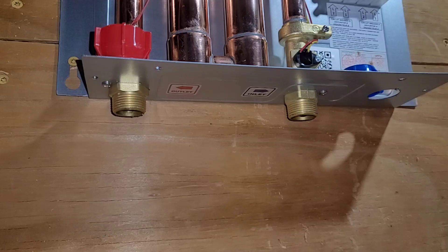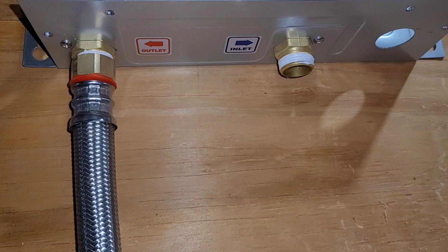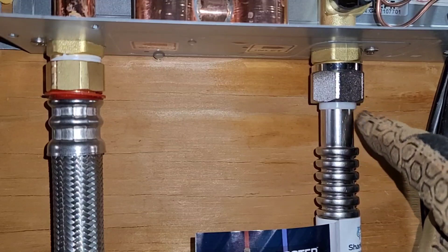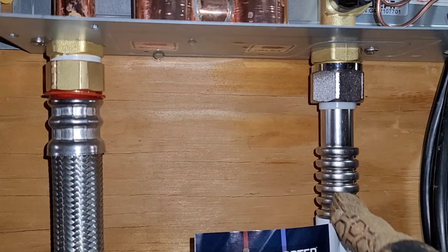For the water supply lines I picked up what they recommended. I put teflon tape on even though there's a rubber gasket on the supply line — just as a precaution. I had some trouble initially with a braided connection; the slightest bend caused it to leak and I couldn't get it to stop. So I went and got a SharkBite fitting. I love SharkBite — they're quick and easy although expensive. This piece screwed right in, I was able to bend it, connect it, and we were on our way.